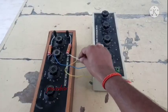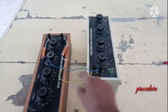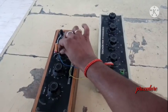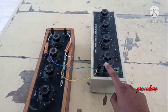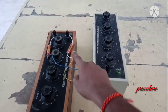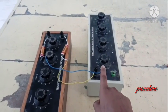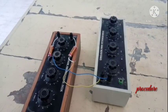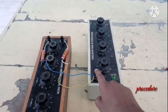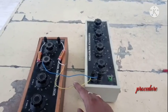Now I have connected the positive terminal of the battery to one knob of the load resistance and the negative terminal of the battery to the other terminal. Since resistance doesn't have any polarity, you can connect the positive to any one knob and the negative to the other. Remember which is the positive terminal of the battery connected to this load resistance, because that should be considered as the positive output voltage.